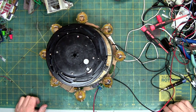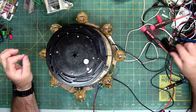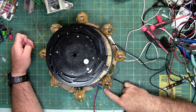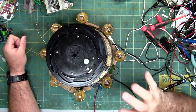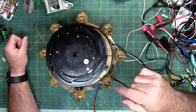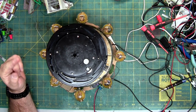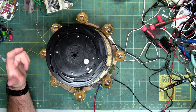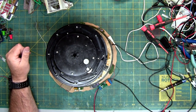The downside is you have to turn this off when the arms are down. If you turn it off mid-cycle, the arms will stay out. The H-bridge circuit board auto-resets every time power comes on — it flashes three times to say it's got power and starts the process. It doesn't care what position the mechanism is in. That's why on this piece, the magnetic clutch comes in handy — it doesn't care if it gets reset mid-cycle. The factory LEMAX circuitry cared a lot about reset position, and now it doesn't work.